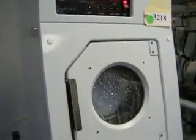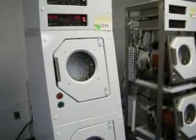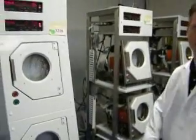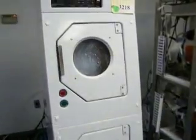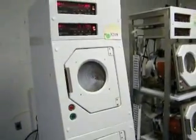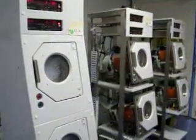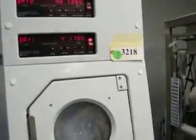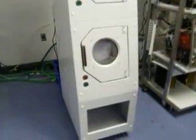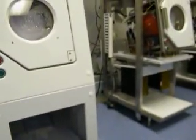In short, we've got a dual stack 870 SRD that's been brought into our facility. All worn parts, especially the chamber bowl, have been completely disassembled and replaced, and it's now in testing mode. The rotors are brand new and balanced to our customer's specific wafer load. What we're seeing is an SRD running to original specifications, ready to be installed in our customer's fab and run for years with no issues given proper maintenance and PMing. We're also getting shots of the resistivity monitors and the backs of the other units still in refurbishment.